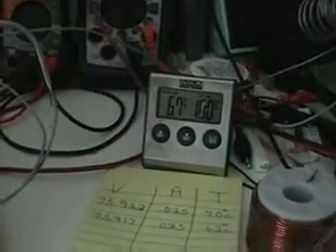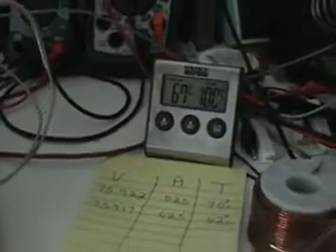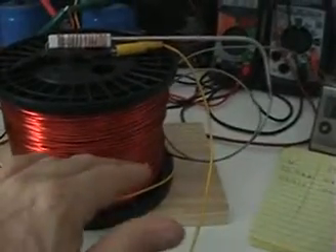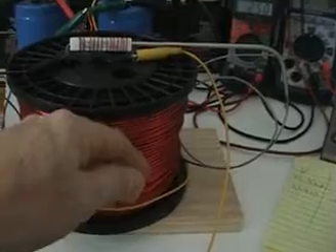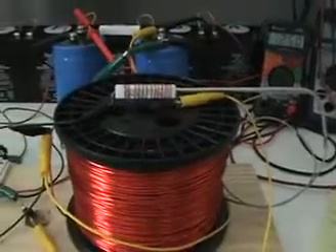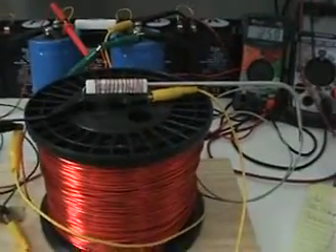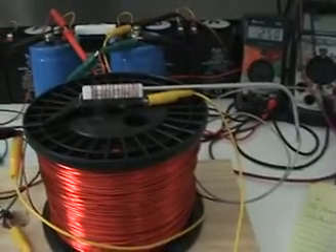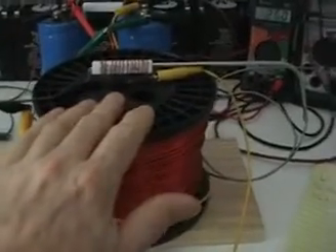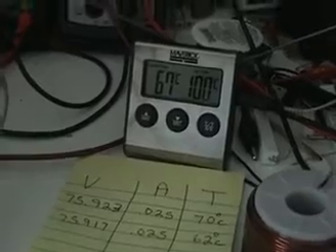Obviously it's showing a better effect utilizing a coil with less resistance. When you have more resistance, that energy is dissipated into the coil and not into the resistor. With less resistance, more heat is dissipated in the resistor. But we still have that magnetic field available while using a coil, and we're only three degrees Celsius off from the direct connection.